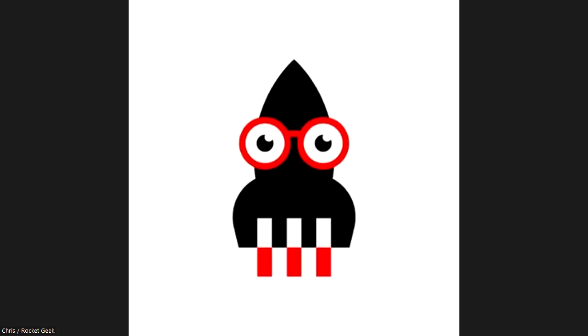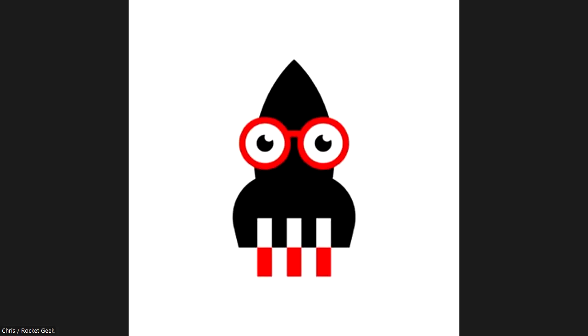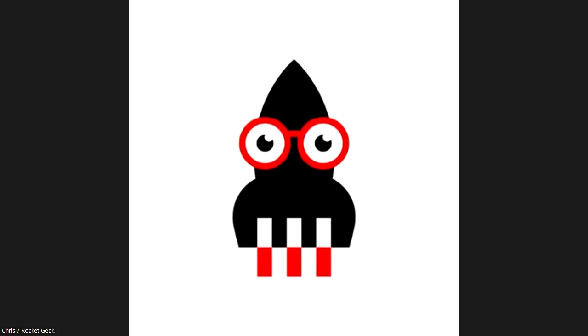All right. Y'all know not to over tighten those, right? Yeah, too much I might break it off. So we'll keep it cool. Well, not break it off, you squish. I had a different team in a different competition over tighten their rail buttons, and they squished them, then they won't slide on the rail. Okay. Yeah, we'll definitely be cautious about that then. So snug, but not too tight. Yeah, that happened to a couple teams last cup where they over tightened them.